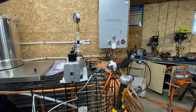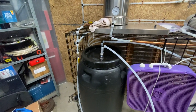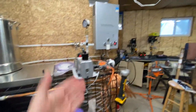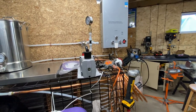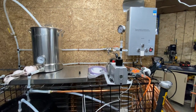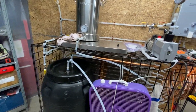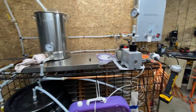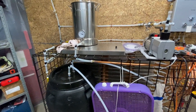Before, it would rise up to 60 really fast, and once the pot got warm it would go right up to 80 Celsius. This display here is in Fahrenheit, but these barrels should handle up to about 170°F. The exact max of these hot water heaters is 85°C — I usually don't take it that high. The output here will hit 85°C well before the barrel gets anywhere near that, and it'll auto shut off. The vacuum pump was used before and will be used again when the vacuum steam turbine gets installed.